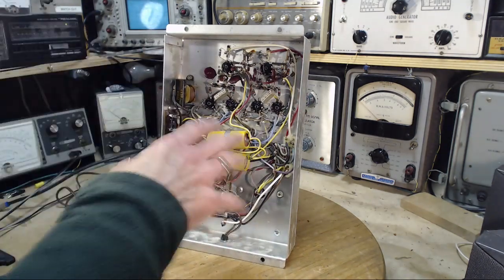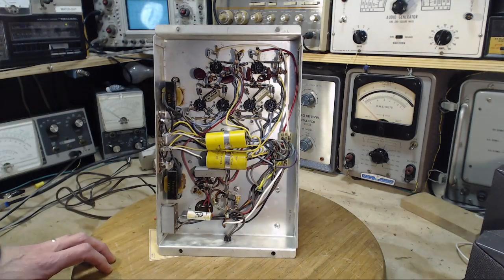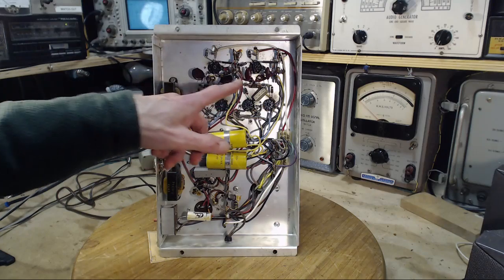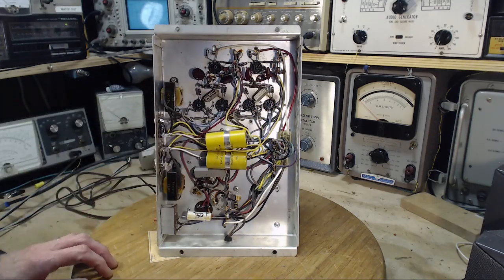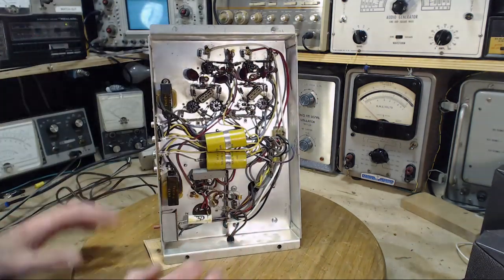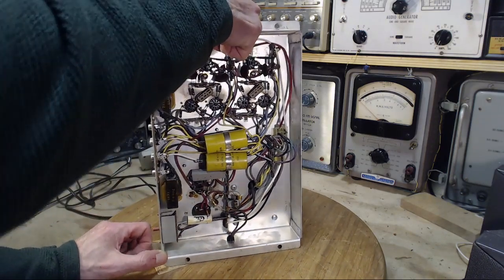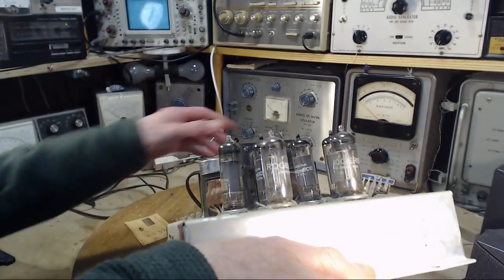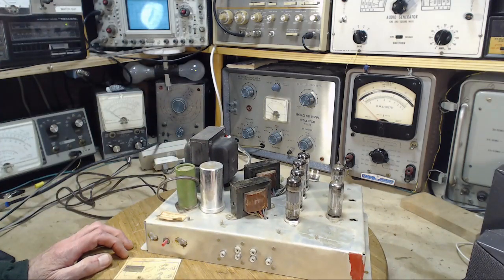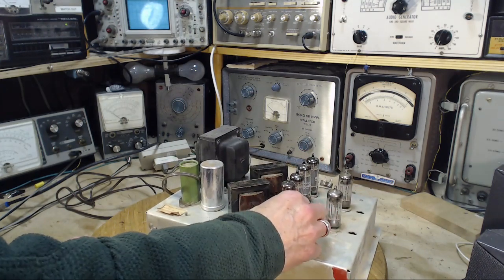Okay, I'm not sure I'm going to extract too much more out of this from looking at it. I went looking for paper capacitors, and no. That era is over by the time this guy's made. It's got this style of capacitor, which are generally quite reliable. So all in all, it looks great. The unreliable components here would be these two guys, but they're not doing heavy service. And of course the tubes could be worn, but it looks like not a lot of mileage.